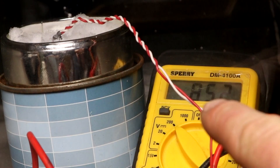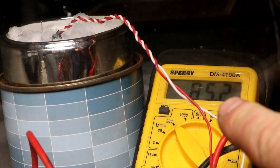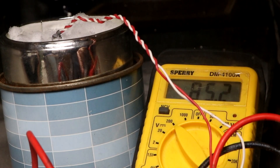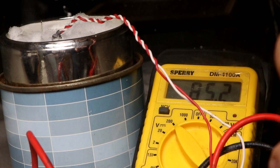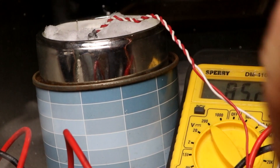Alright, so it's been about 40 minutes. We've got down to 85.2 ohms. I think that corresponds to negative 15 degrees Fahrenheit, or negative 26 degrees Celsius. So yeah, that did get very cold.